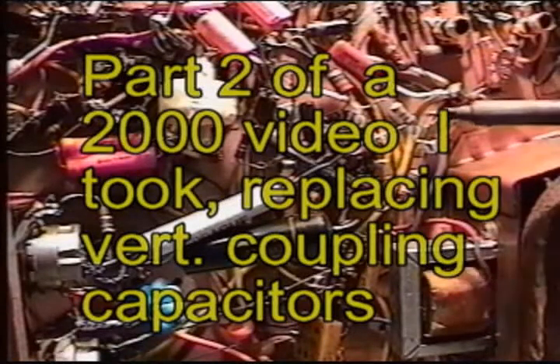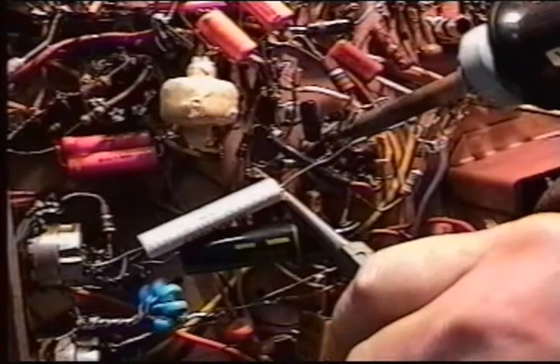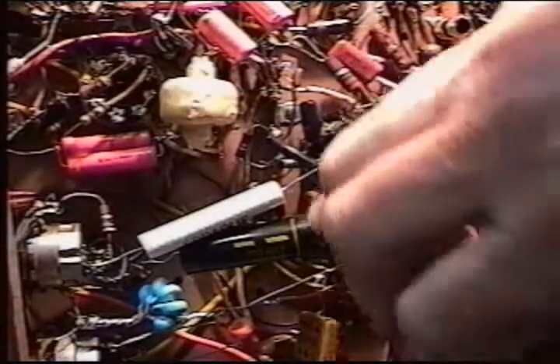I'm going to attempt to pull off this lead here. I don't know if I can do that from here — I think I'm going to have to clip it. Get this out of the way and clip this. This is the original lead from the old capacitor that was in there, the original one before I put the black ones in. It's generally customary to tack them in like this until we get the proper ones. Let me get a heavy-duty nipper here — I can nip this out.